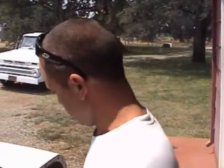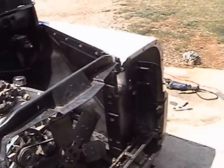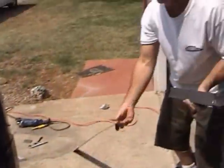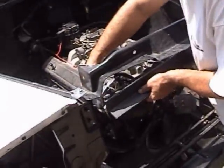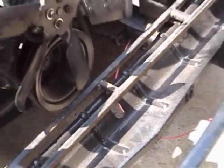Take the other piece of channel you just saw for the top, put it in like this, and then we'll be able to take this 2-inch flat stock, and we'll come right off of that and bracket it in, and it'll hold the radiator perfect. And it'll be able to be taken out. It'll be bulletproof too, it won't go nowhere. And then we have welding points for the tranny cooler.